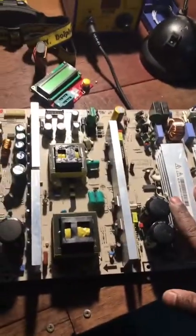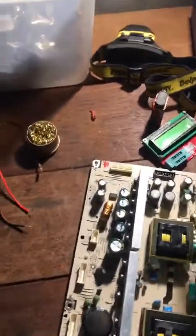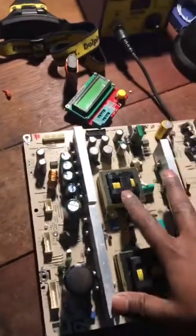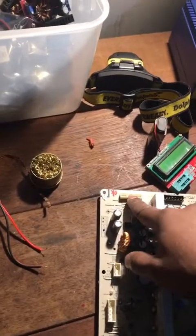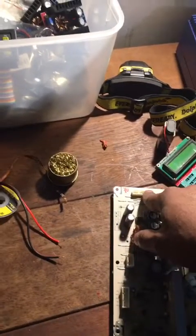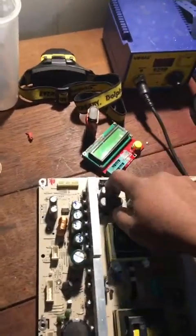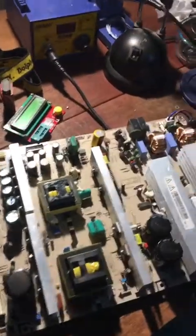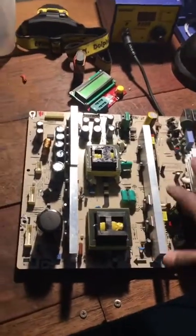So you're pulling 15 amps or whatever — if you're going to short yourself out. The trick to power this while it's on the board is to ground the enable pin — I think it's the fourth pin — to ground. That way you can actually turn it on and see all the 12 volts, 5 volts, all the outputs coming out. It's an easy way to test this. If you have any questions, leave a comment below.